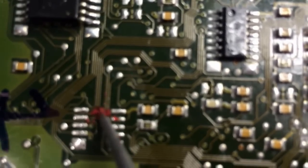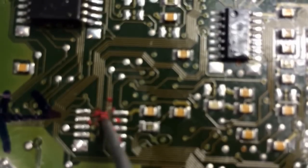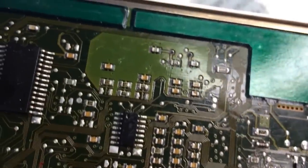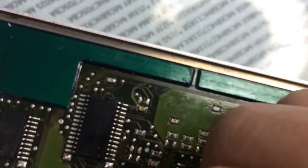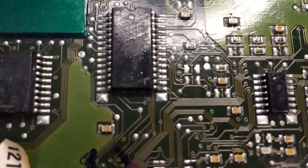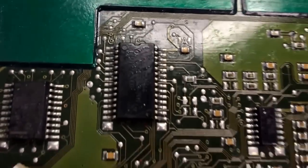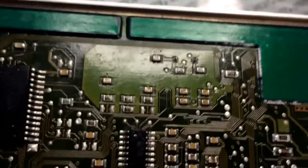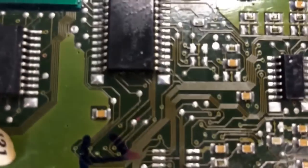You have to be very careful not to ruin the circuit board. Once you have it warmed up a little bit with the heat gun, it'll actually be easier. Get that removed and clean it up again with acetone. Now get your soldering iron and touch the tracks just a little bit — that way it will melt the track and be perfectly smooth and even, so when you place your chip on, it'll sit nicely.